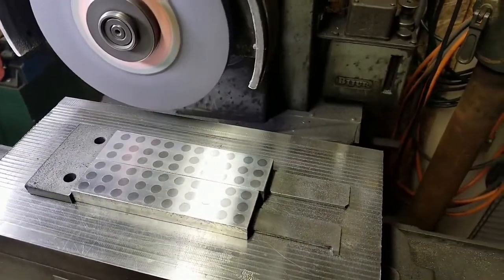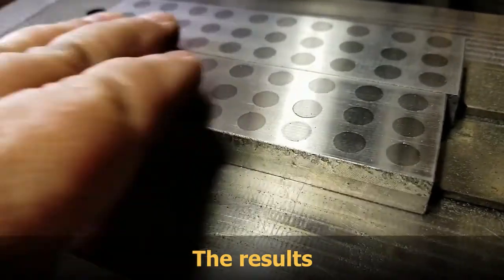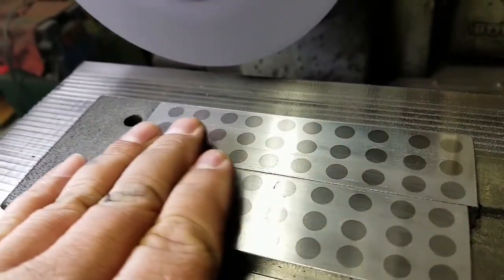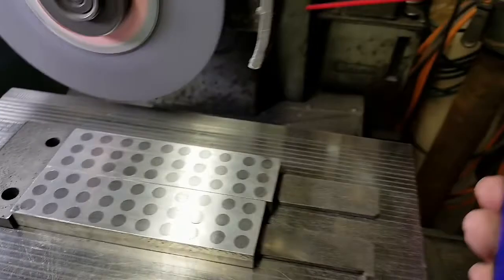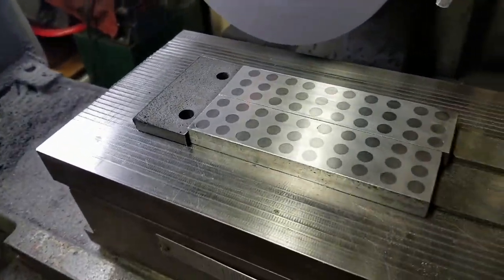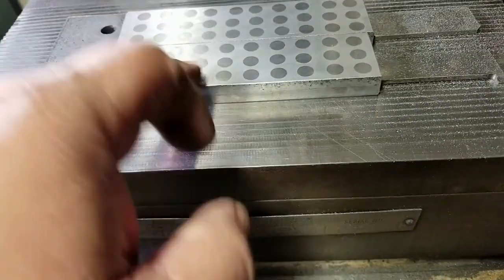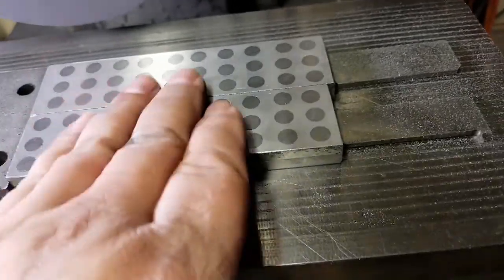The camera stopped while I was moving it but I haven't done anything and you can see there's very little grinding marks on there whatsoever. There might be a couple little pecker tracks here and there from when I was roughing it. My secret has always been WD-40 — obviously I purchased this cam myself, no sponsors here. I've been using WD-40 for as long as I've been in the trade. It works on aluminum, it works on Amco bronze, it works on bronze, works on brass — works pretty much on most non-ferrous materials. And it gives you a good finish.